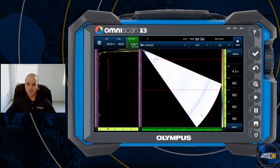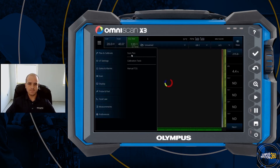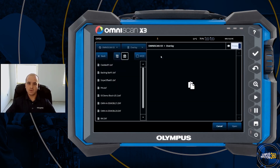The first thing I'm going to show you is custom overlays with the DXF import function. We go to plan and calibrate into our scan plan. On the left hand side you'll see a drop-down box for overlays. You can select none — maybe you're doing a zero degree corrosion scan without a weld — or select welds for all standard overlays. Now there is also a custom option, which gives you the ability to import DXF files created in SolidWorks, AutoCAD, or drawn and exported from ESBeamTool.